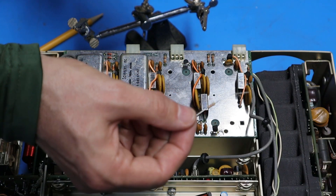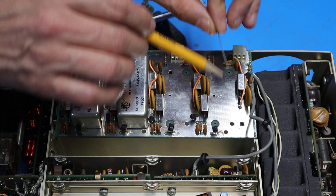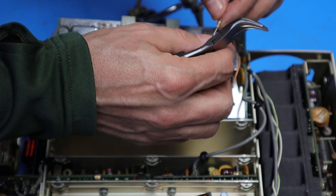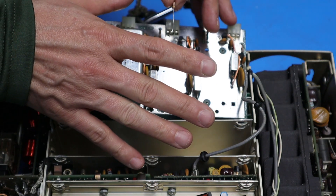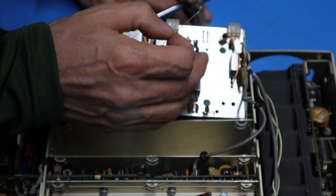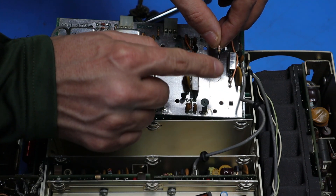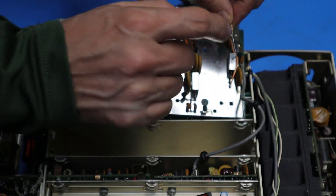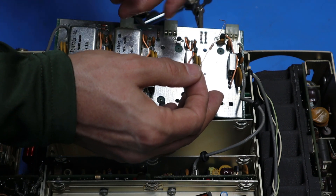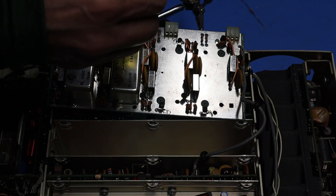I'm going to use a 470 ohm quarter-watt resistor and put it in the open slot on the filter board. I'll solder one lead to this plated-through hole and the other to this plated-through hole. According to the article on the website — which I'll link below — the value of the resistor is not super critical. A lower value resistor will pass more signal but may result in front-end overload; a higher value will pass a little less signal but should prevent overload. The author also mentioned that wattage rating isn't critical, but he used a 2-watt resistor because the lead diameter fit the holes nicely. The closest resistor I had to the 450 ohm he used was this 470 ohm quarter-watt, and wattage isn't important because there isn't a lot of power being passed through.